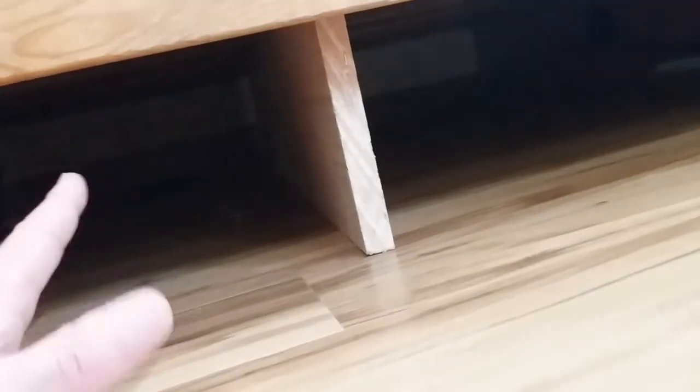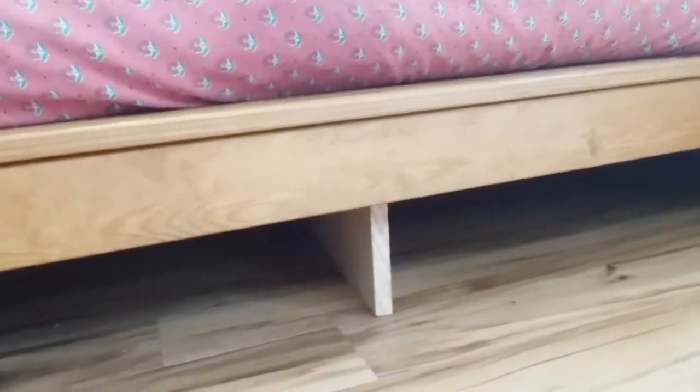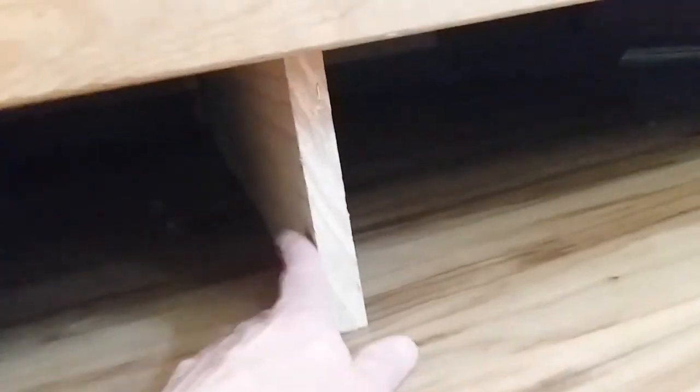And then all I've done is just wedge that board right in there, and I've tested this with 300 pounds on the futon, and there's absolutely no creaking or sagging of those boards as typically would be. If you're exceeding 200 pounds with these types of futons, you definitely want to have some structural support in the center. And this is a cheap do-it-yourself fix.